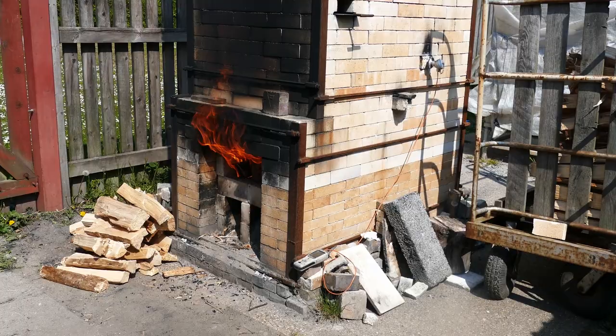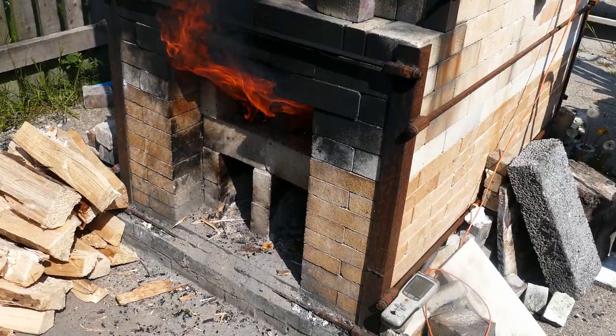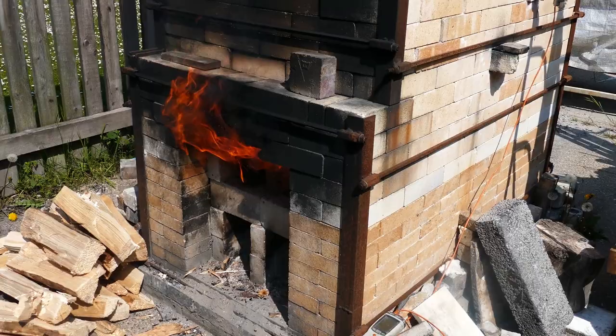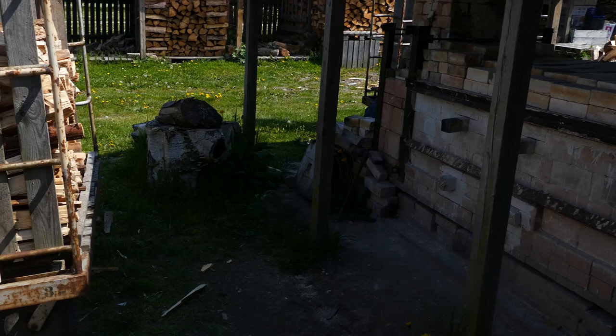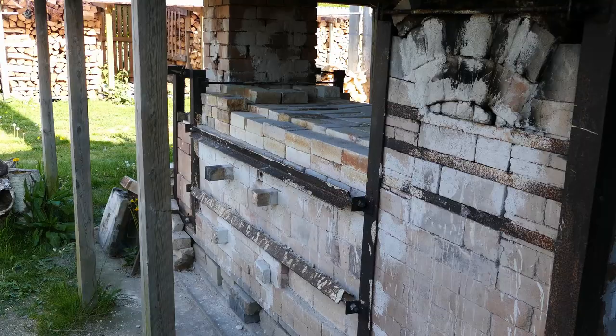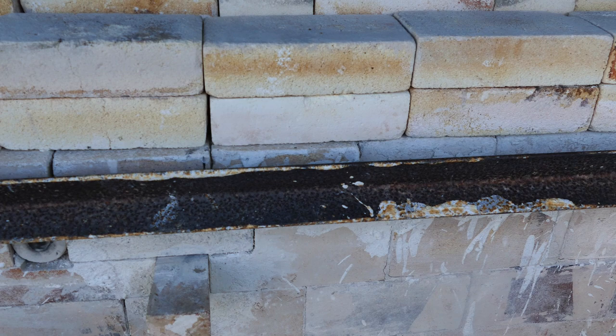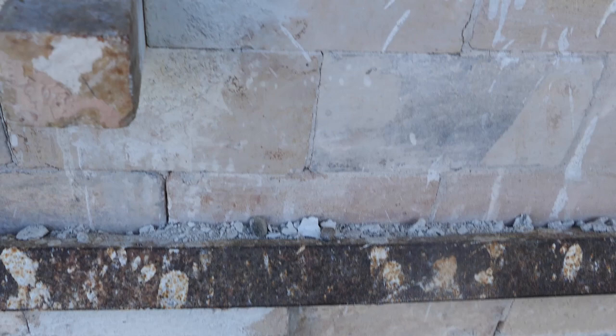Now we're introducing the first body reduction on the small kiln — it's going a bit crazy and the temperature is about 830 degrees. We're also doing the fifth body reduction on the big kiln, with lots of nice smoke coming up. We've now reached cone 5, which is about 1196 degrees — we can see the first cone has bent, though it's a little difficult to see.